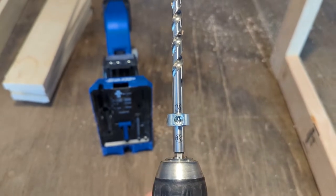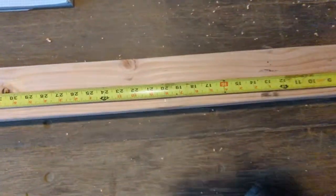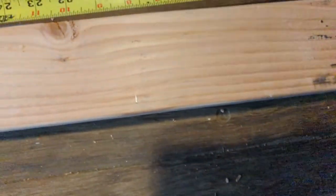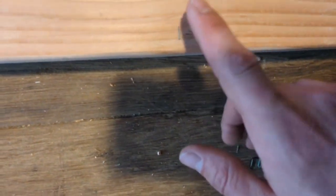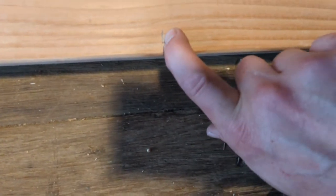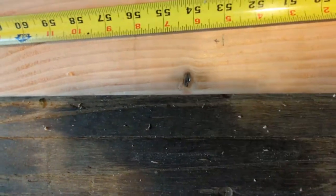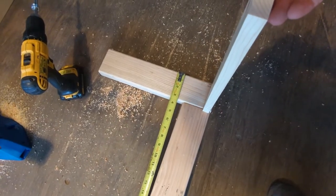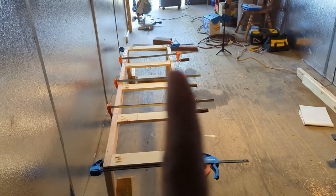Since the piece I'm putting the pocket holes in is only three-quarter inch, I'm going to use the three-quarter-inch setting on the drill bit. I have it marked — the back part of the board is going to be there, going back to here. Up here, since that's in front of the wheel well, I put an arrow indicating the edge of my board will fill in here, and back here it'll line up with the 2x4. I've got it clamped into place, so now I'm going to drive in all of these pocket screws over here into that side.